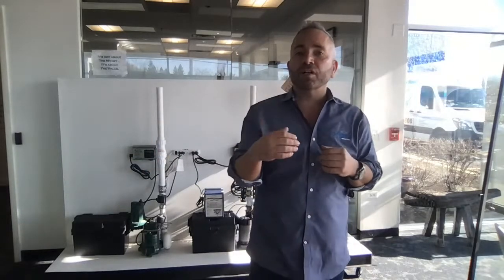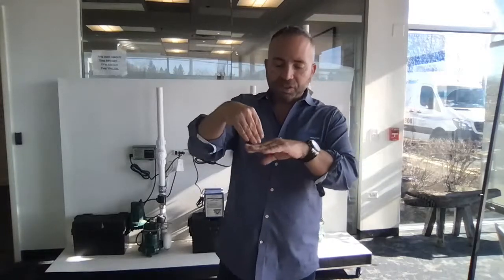We had Dave from Florida write us — he used to live up here and asked why water getting into the basement of a house matters. It creates mold and a mold environment, and it could ruin things in your basement — your furnace, creating rust. All that moisture can ruin beautiful carpets and fixtures. Even if you've built out the basement using wood for the walls, that wood soaks up the water. Drywall is like a wick — if it touches the ground and water comes, it just wicks it up, and then you have major catastrophes.